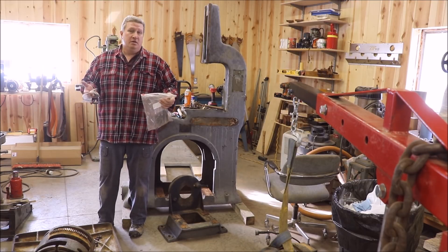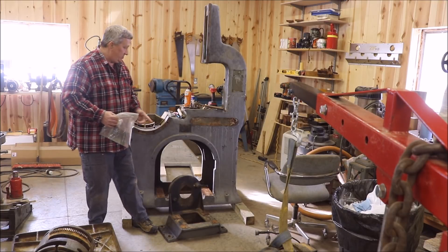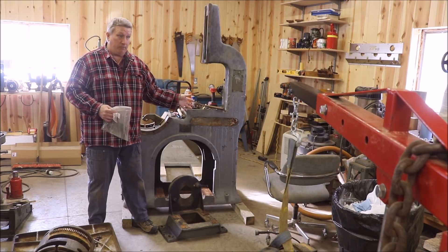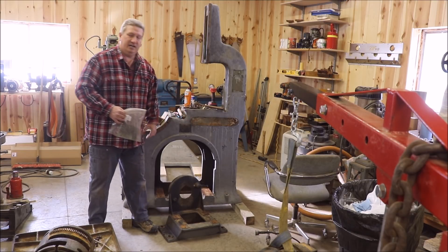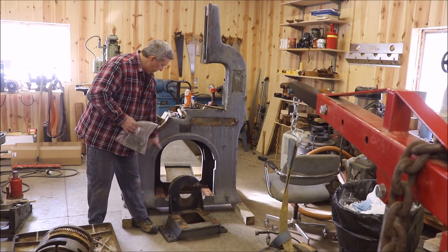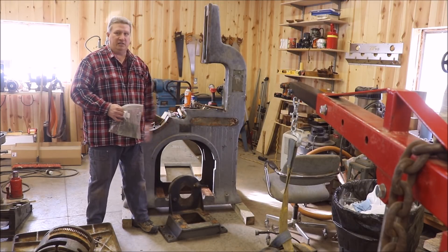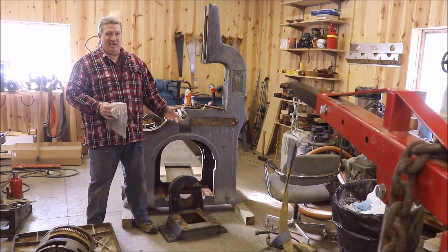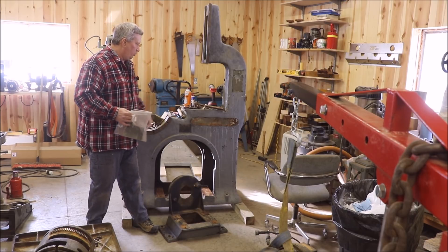This table is filled with plastic baggies - lunch baggies and bigger ones. It's very important that you keep these things all organized and separate so you can very quickly go through them, clean them, and wire wheel them. We're going to be wire wheeling all the nuts and bolts, polishing everything up, assessing any threads that are damaged. I'll take a tap of the correct size and thread pitch and go through all the different holes and re-tap them all and clean them up. Get some oil in there. Any rounded-over threads will get cleaned up so we're not going to have any problems with stripping threads. It's all a part of doing a really good quality restoration.